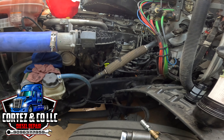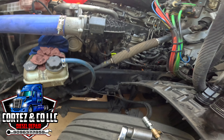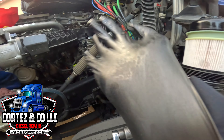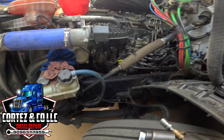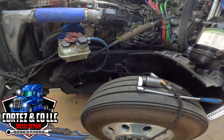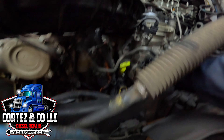I was going over the footage from yesterday when I was assembling the pump, and I did mention it would need 90 PSI — that was a mistake on my part. It doesn't actually take 90 PSI into it, but it builds about 90 PSI once it's running. So as long as you prime up the filters, you should be good with this pump. With that being said, let me get these filters on.